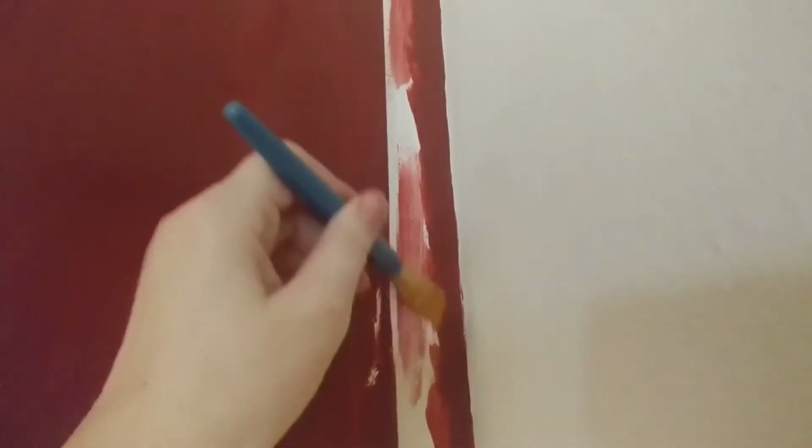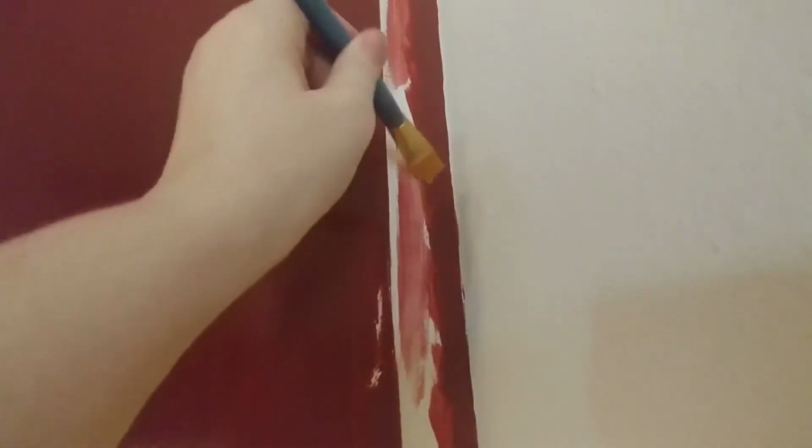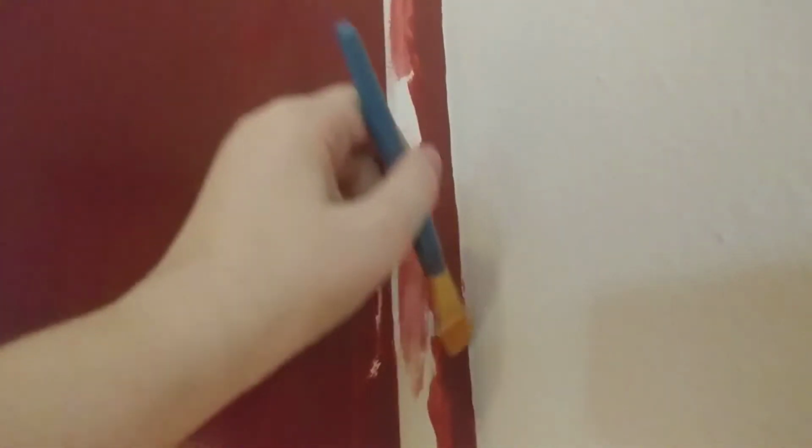And so what I did was, once I ran out of enough paint to paint on the wall, on the side there, I just take my paintbrush and kind of feather it out. That's why you see all those swipe marks, just to thin out that paint. So when I come back with subsequent layers, when I'm done painting the cabinet doors and drawer fronts, and I come back in with the smaller paint pad, or my paintbrush, then I won't have that drastic line telegraphing through my subsequent paint coats.